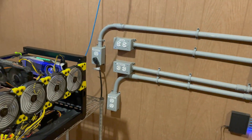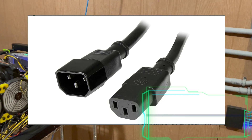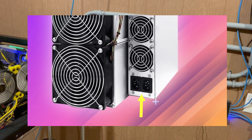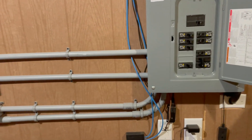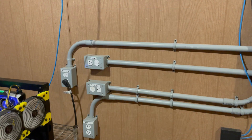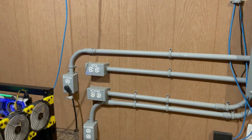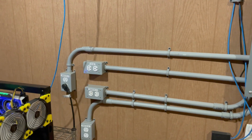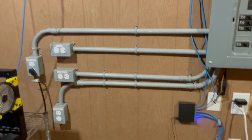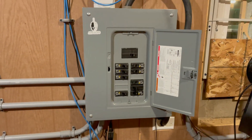There's a device called a PDU that takes C14 and C13 cables - your traditional computer and ASIC miner cables. On the KA3 and most ASIC miners you'll see two C13 and C14 cable connections. The PDU has an L6 240 volt plug on the end. You wire that L6 plug to a 30 amp breaker, then run your ASIC miner C13 or C14 cables to the PDU and it runs at 240 volts. With 30 amps at 240 volts, it can handle 7200 watts.